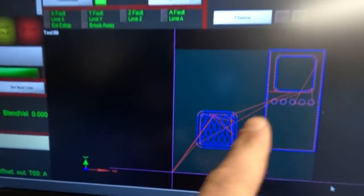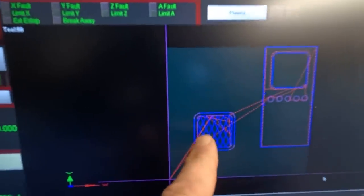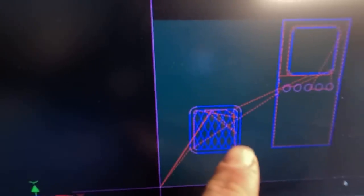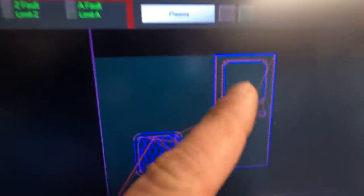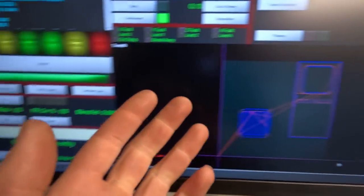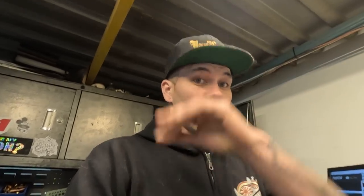Right, so the next thing we're trying to do right now is the bead rolled insert that goes in the back of this seat. We're gonna scribe our diamond pattern and bead roll flange pattern that will be sitting in the back of this seat. And then we're gonna scribe all these holes. Then it's supposed to pause for a second while we take the easy scriber off, change to our 45 amp consumable, and then it should just go right back to finish all of its cuts.